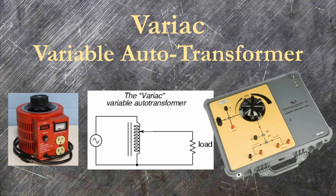The word variac refers to a variable single-winding auto transformer. They're inefficient for general power but are extremely handy as test equipment because you can get nearly any voltage from 0 to 120 VAC out of a single phase 120 volt outlet. When you turn the knob, a brush contact moves across an exposed section of the winding, making the used portion of the winding shorter and lowering the output voltage. Fancy ones like the Vanguard unit allow you to get DC output as well. Pretty neat.